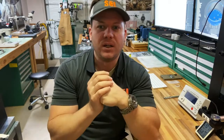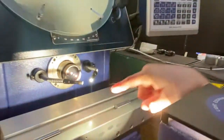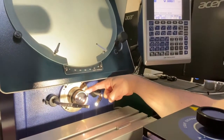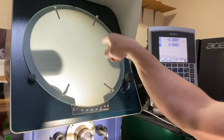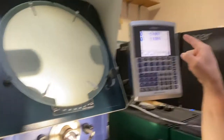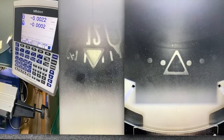To eliminate those factors and actually figure out if the bezel is truly aligned with the dial, we use an optical comparator, because it only has one lens, so there is no parallax error in the measurement. We put the watch here, and this single lens looks at the front of the watch and projects an image onto the screen. We're able to take measurements on this system to a ten-thousandth of an inch and actually look at that alignment.